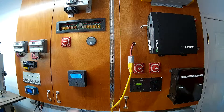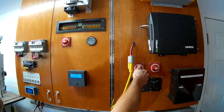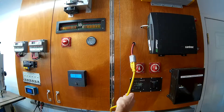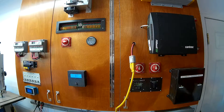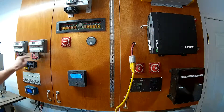I'm going to start by powering down the inverters. I've already moved the loads over to an extension cord temporarily and I'm running all the loads that would have been on solar off the grid for now. I'll go ahead and disconnect my three charge controllers.